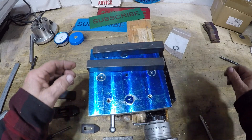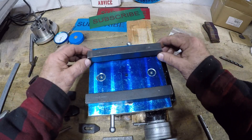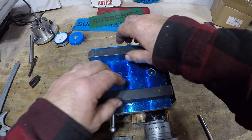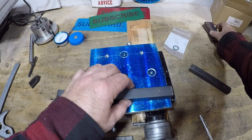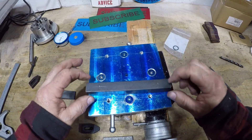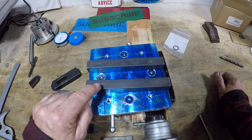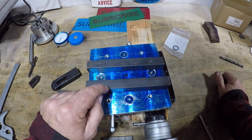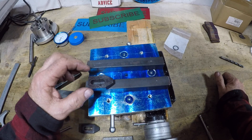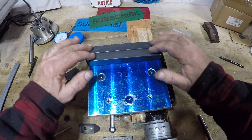What we're going to start making is a set of clamps that will go across the entire rotary table, so when we clamp something down — that's obviously the length of it — we can work with it. I already have it laid out here: inch in, inch, half of that. We're going to drill a 5/16 inch hole and then machine a slot similar to this, maybe the same size length. That'll give us some wiggle room. We're going to start with those two.